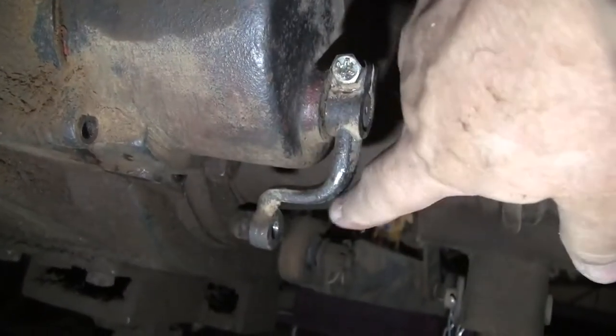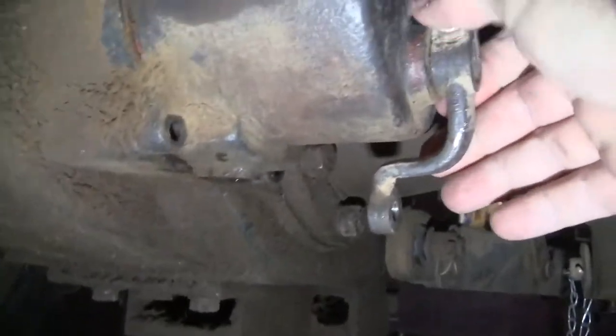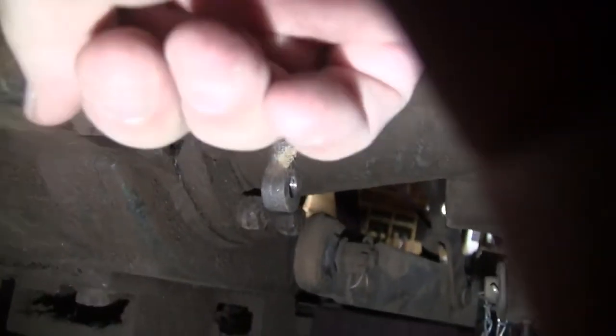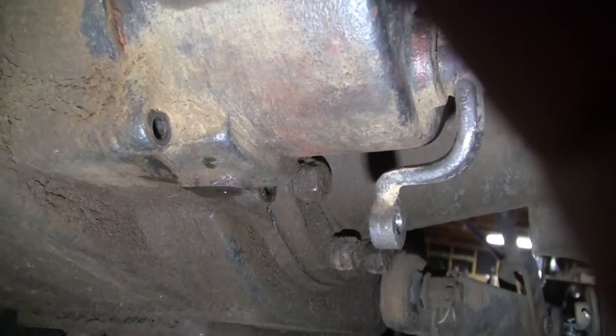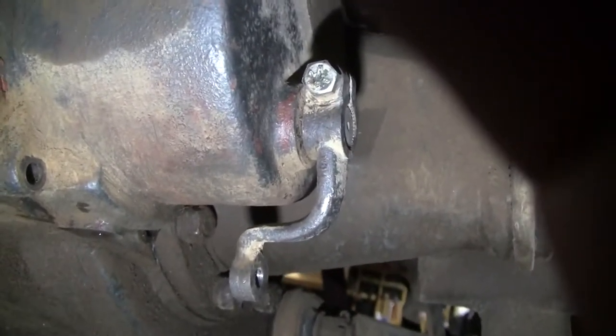All right, here's the, I don't know what the factory calls it, it's just a lever to actuate the brakes. It's kind of stiff right now. And this is what connects to it, this clevis and this rod, which you can see is adjustable. There's a pin in there, cotter pin comes off and gets out of the way. And now I've got the bottom screws out here and one on the other side. So now I'm going to take a mallet. This is cast iron and they're very expensive. So I'm going to take a mallet and see if I can break this loose. It's been off once, so I suspect that it's glued on. Be right back.